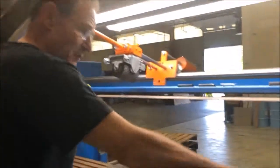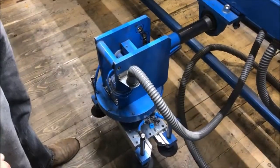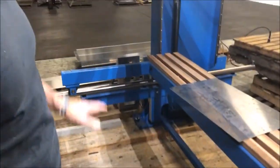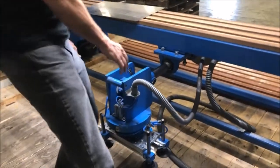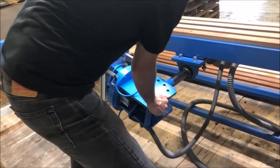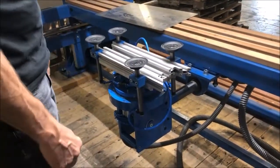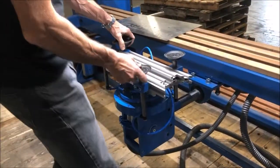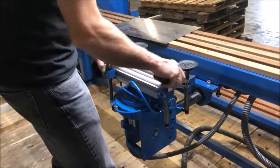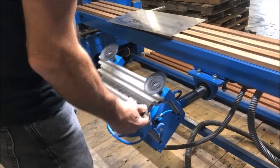On this machine you have a wooden table. The front two thirds right now is behind the machine, and underneath this you have the handling unit — so this is stored away. They also made an aluminum pan for bigger parts where you can go a little bit lower. When you buy the option of a handling unit, you can bring it up to the vertical with a little click where you feel exactly where you are in the right position. Then you can rotate 90 degrees and rotate the head — the head goes pretty much endless, and it indexes at 90 degrees. This indexes every 22 and a half degrees.